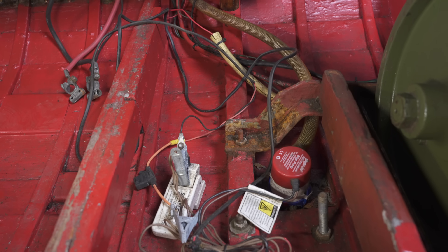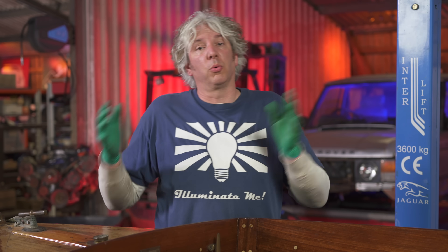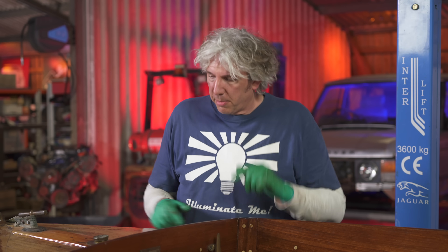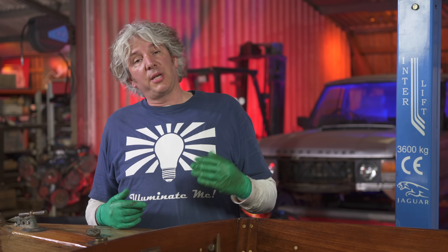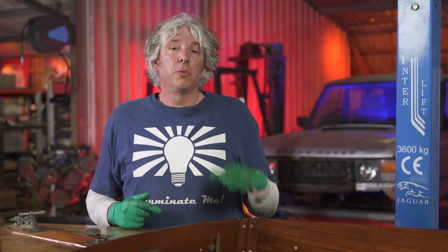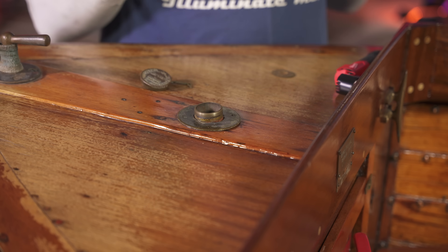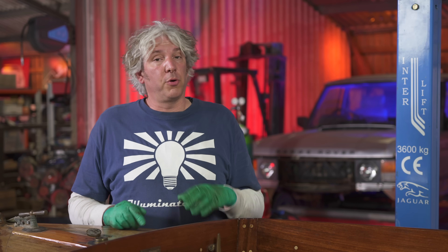The first obvious thing is that the wiring is in quite a state, and we will need to rely on that very shortly when I try and start the motor. But there are a number of things you have to do before you take a boat out of the water and leave it out for any length of time. One of the first things is make sure that all the coolant system is drained down — there's nothing left in the exhaust because that could rot over time — but also make sure there's no fuel in the fuel tank. That's looking pretty dry, which is particularly important nowadays with all the ethanol in our fuel, as that plays havoc with seals and gaskets. So it definitely makes sense to drain that out, especially if you're going to leave it for a very long time out of the water.